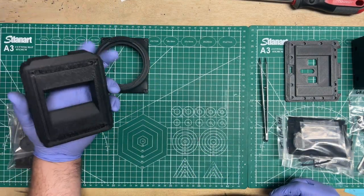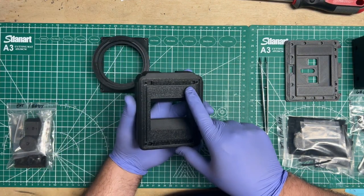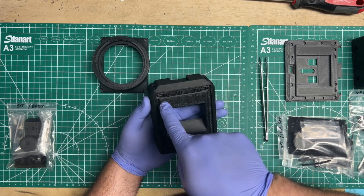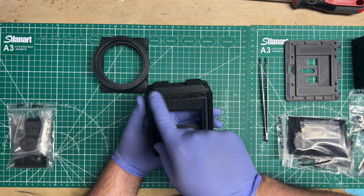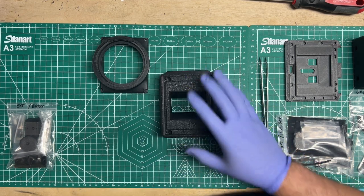And it's very important that you make sure that you clean everything out so that the nuts can go correctly all the way into where they're supposed to go. So your screws come in level, because if not, if they come in at an angle, then you're going to jam it, and then you're going to strip it, and you're going to be basically free spinning it in it, and the screw's going to be stuck.